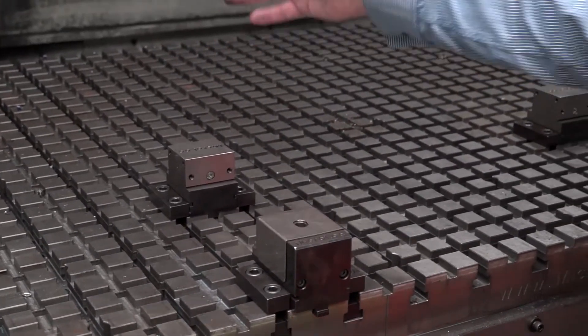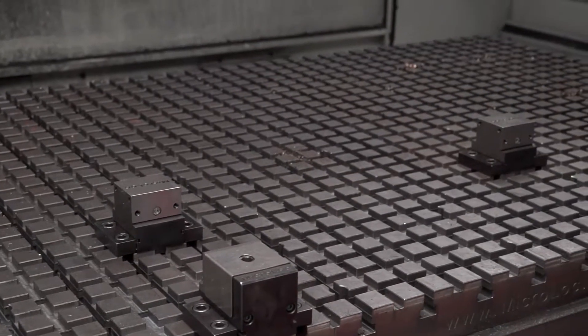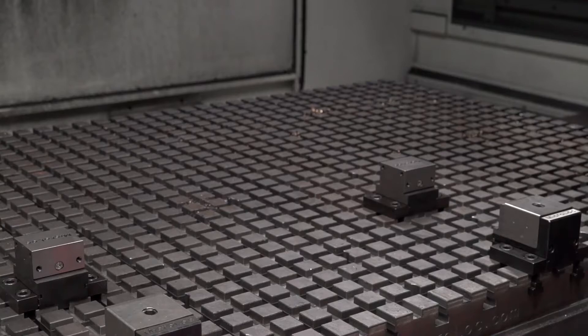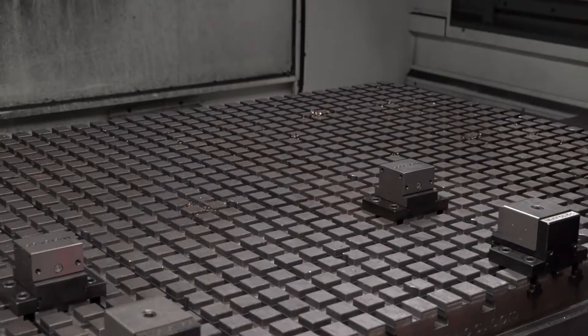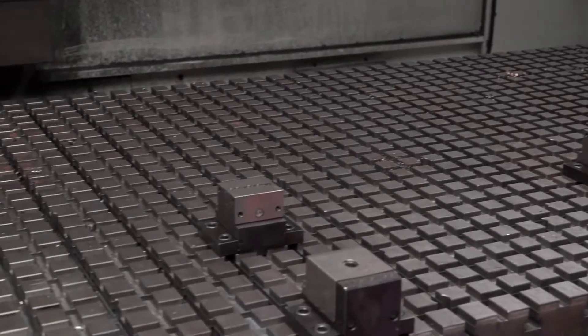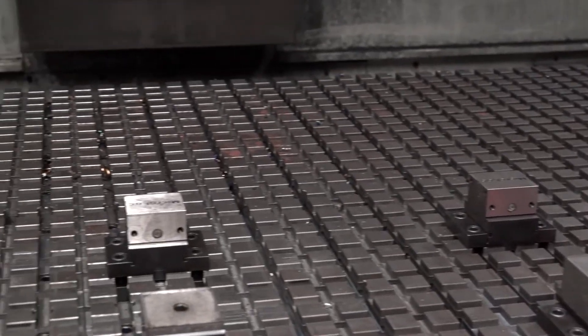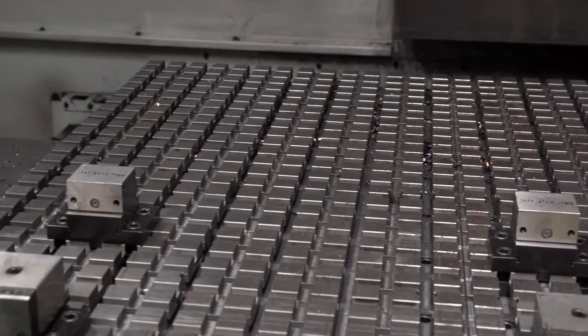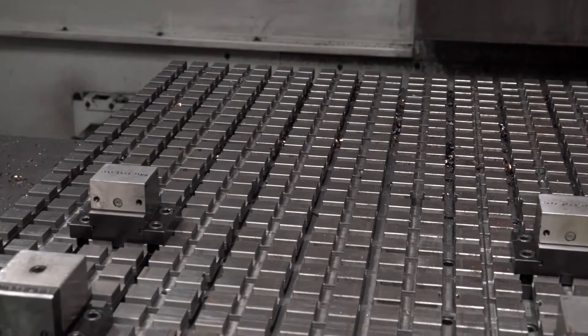Because it's modular, we can put another clamp facing the other way and put multiple parts on and build it up across the bed. One of the big advantages is you could move that locator right to the back of the plate and know exactly the dimension or where it is in relation to the table, because it's a precision ground base and each slot is 75mm from the next. That's correct — we know exactly where each datum point is.